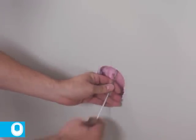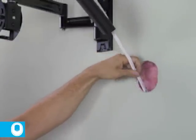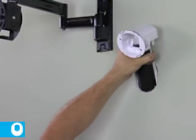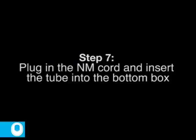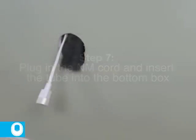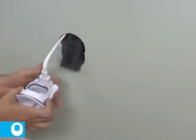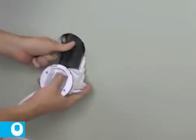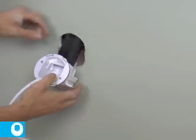Insert the fishtape into the bottom hole. If there is insulation in the wall, try to bias it against the back of the drywall sheet. Once the fishtape has appeared at the top hole, hook the tube assembly to the fishtape and pull the fishtape and the tube assembly down to the bottom hole. Attach the NM cord to the box — make sure that it is completely seated and that both clips have snapped over the plug. Now attach the cable tube to the box, making sure the gasket is completely seated, and insert the tube as far as possible. Look inside the box to confirm the tube is fully contacting the gasket.